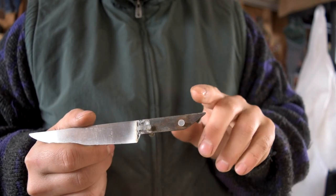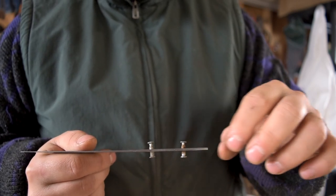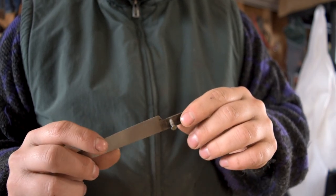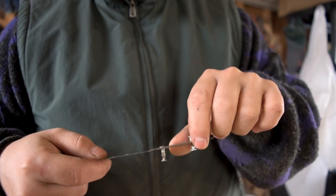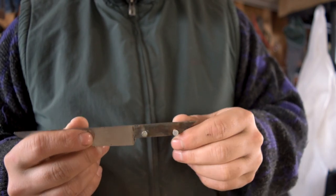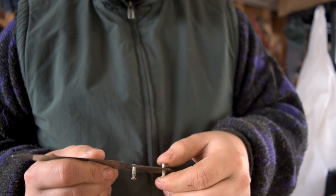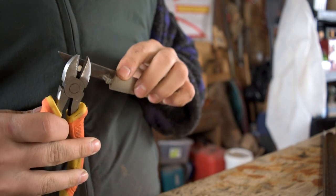What I'm going to do is actually build a tang here. I thought about filling in with 3/32nds micarta, but then you'd see the tang and it just wouldn't be a good look. I'm not sure what type of handle this thing had on it. Looking at the inside of the tang, it wasn't exposed, so the handle would have been out. There might have been a notch cut down in wood that it sat in and was riveted. The pins are still on there — I'm going to cut those out because we're going to do our own pins. We'll extend this tang.